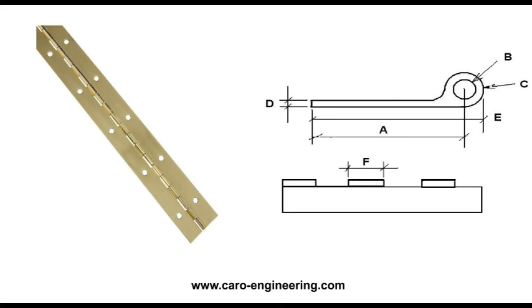The challenge here is to keep the hinge pin from falling out. Bending the ends is the most secure way, but that means it cannot be removed without cutting. The other challenge is lubricating the hinge and keeping it clean and free from dust. The latter is just about impossible, so it will wear eventually, and when the play increases or the wall thickness of the bracket material gets too thin, the hinge will have to be replaced.